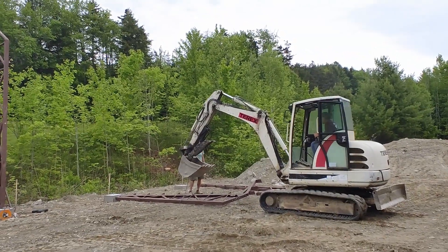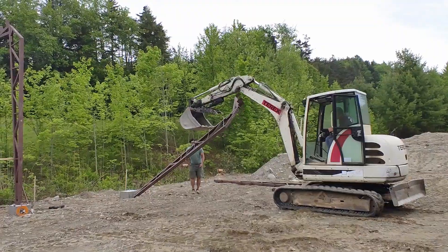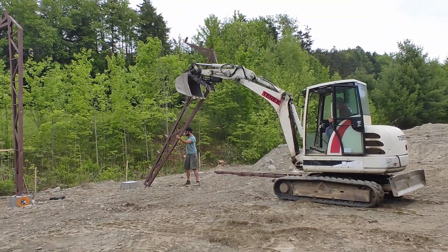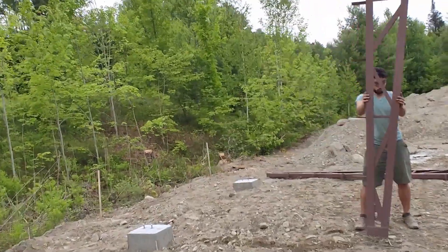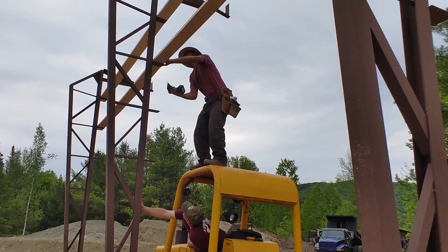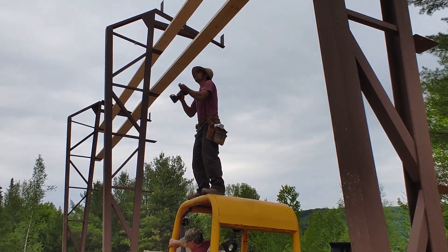Here you can see our method of lifting the posts or wall legs. We used an HR-18 mini excavator Terex, a pretty small machine at about 11,000 pounds. We lifted with a chain pretty high up on the webbed leg and then set it onto two pieces of threaded rod embedded in the concrete. Those two bits of threaded rod, once bolted down, held the post vertical enough for us to begin working, but the more pieces you could tie together the better.